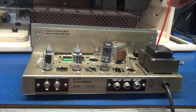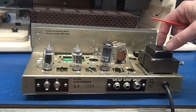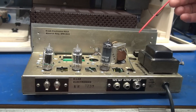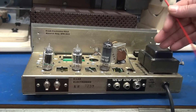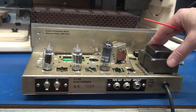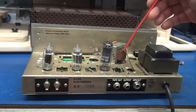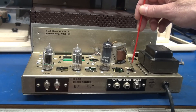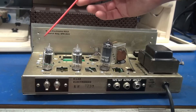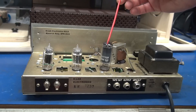So I was not able to utilize that 6x4. I replaced the power transformer, and it needed to be solid-state rectified to deliver the power I needed for the 6CL6. But if you get one of these units and the original power transformer is good, use it and use the 6x4, then go ahead and build the rest of the circuit.